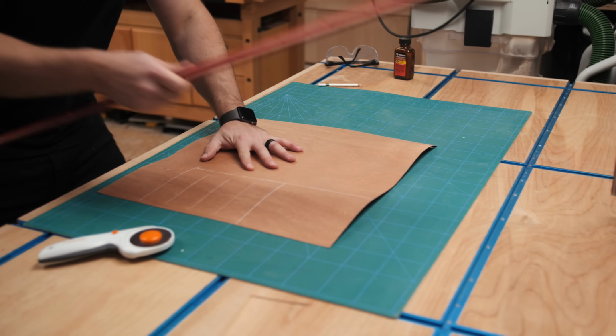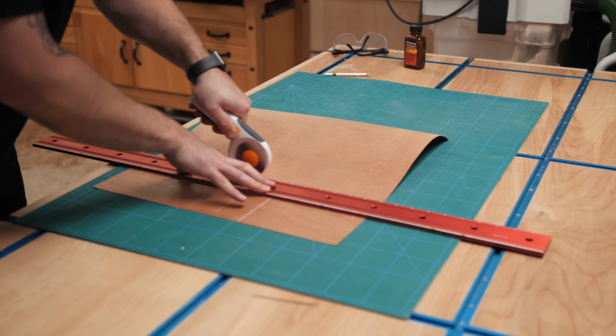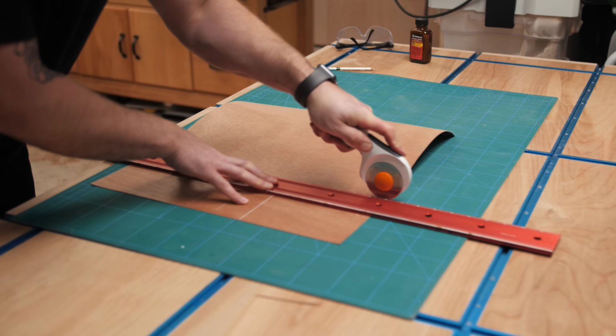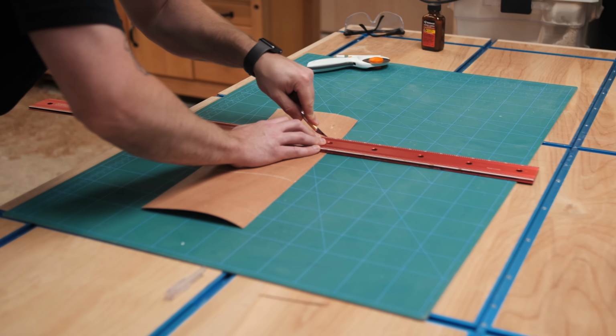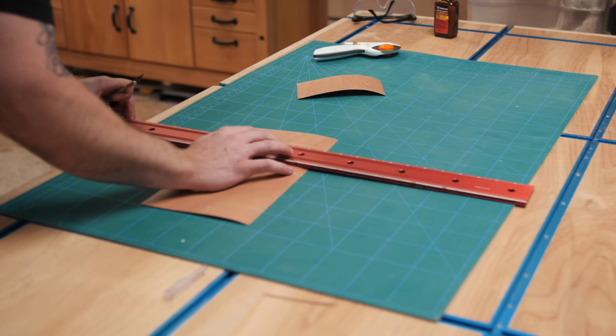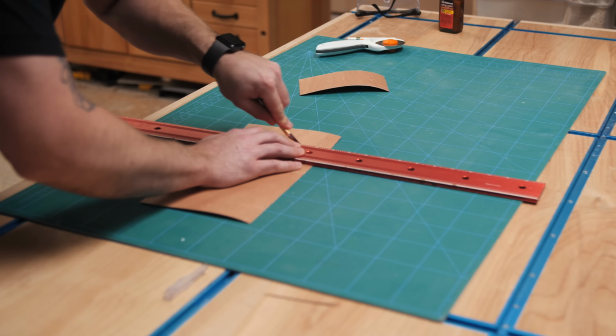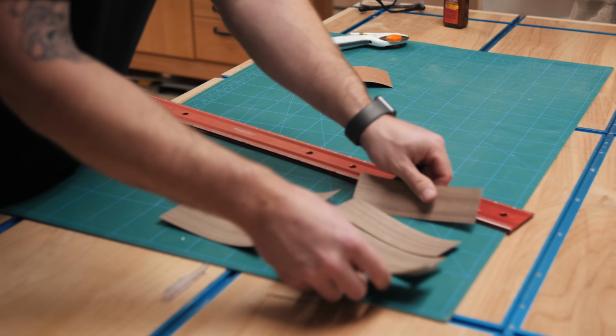And I actually used the leftover walnut veneer from Rockler that I used on my bent lamination guitar hanger project, first marking out the sizes of the pieces I needed to cover the 5 faces of the base. And I first tried using a rotary cutter to cut the veneer before remembering that an X-Acto knife worked a lot better on that guitar hanger project, and I just used a straight edge to help guide the X-Acto knife and just made the cuts in a few passes.